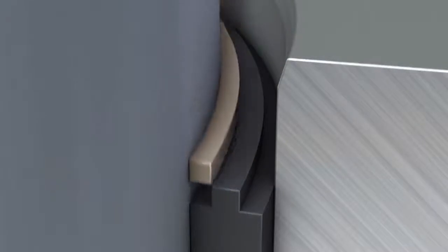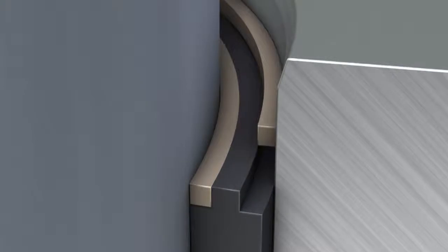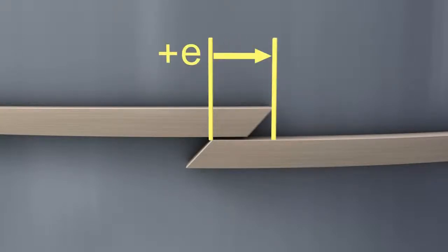If 2 backup rings are included, the second ring has to be cut slightly longer due to its position at the outside diameter. Remember to add the longitudinal allowance in length prior to cutting. This allowance is according to table number 2 in the mounting instruction.